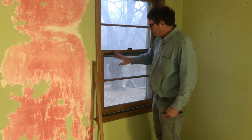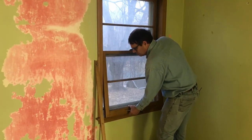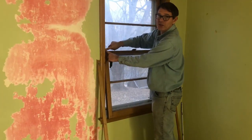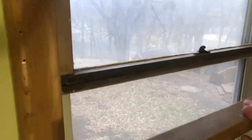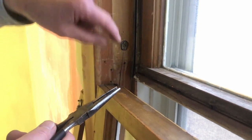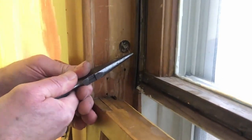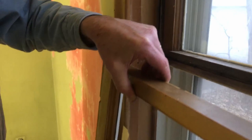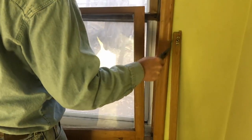Now the parting strips have been removed. I've taken the sash almost all the way down, tip the sash out, and then just over the sill I'm sliding it down because right now the window is still engaged in the upper parting strip. I'm going to get it down and then clear, tip it out, and now I'm going to remove both of these two sash cord assists. This metal wire is pretty thin, so you have to be careful. I'm taking my needle nose pliers and coming up underneath it, pulling up very gently, then pulling it out and slowly letting it all the way back in. I'm going to do the same thing to the other side.